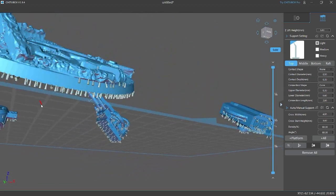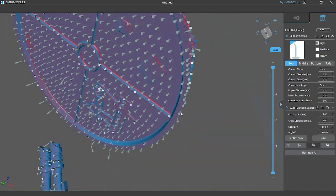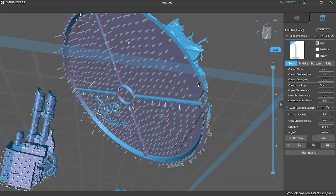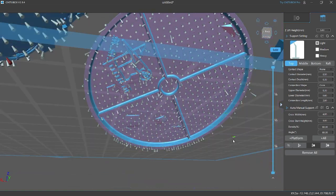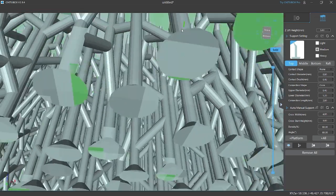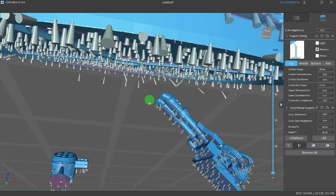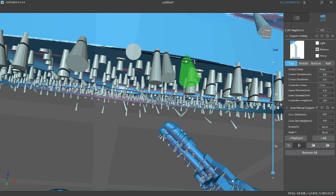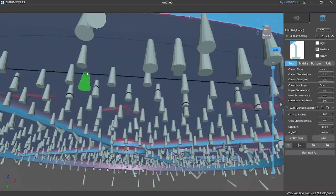Turn off the supports visibility so we can see the model clearly. Get reoriented and find where the bottom first touches the build plate. The edging is super important on wider models — figures can look well-supported overall but if the very edges aren't supported there will be warpage. Where the model shows red is where gravity is no longer your friend — things are starting to hang over. Where the gray dots and lines appear, gravity has fully betrayed you and a support is needed right there.